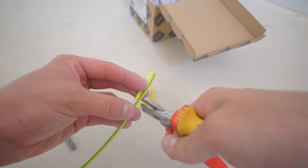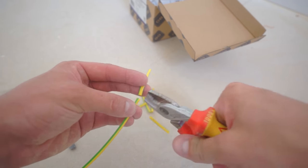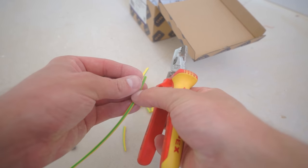Another tip — tip number four — that goes hand-in-hand with pre-stripping is sleeving up. Especially commercially where there's blue sleeving, brown sleeving, and other sleeving types, it's super important. But even domestically, cut all your sleeving beforehand. If you know you need an inch of sleeving for every downlighter and five inches for every socket, get all those cut in a little box to carry around with you.